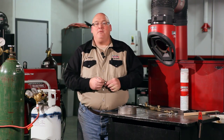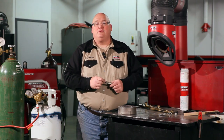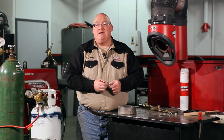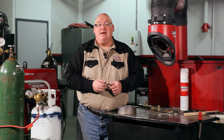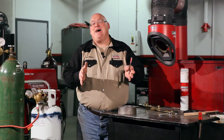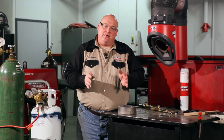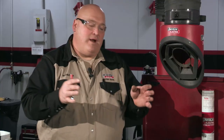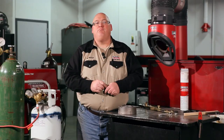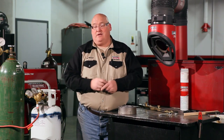If I'm going to limit myself to a thermal parameter, I will take a 300 degree Tempilstik, a 500 degree Tempilstik, and maybe an 800 or 900 degree Tempilstik. I can stay within that range of temperature to keep the casting from getting a lot of stresses. Therefore, when I'm done with the casting, I can slow cool it, either wrapping the casting in a fireproof blanket or putting the casting in an oven and dropping it down 50 degrees an hour.